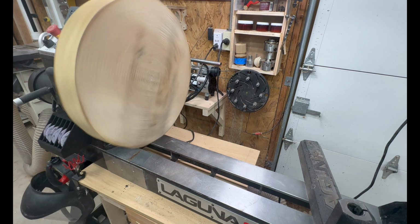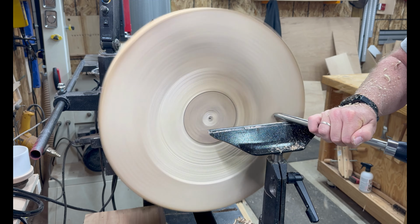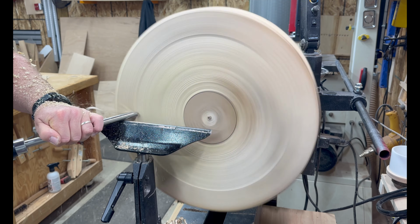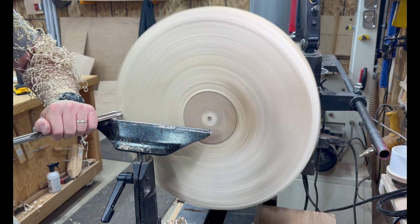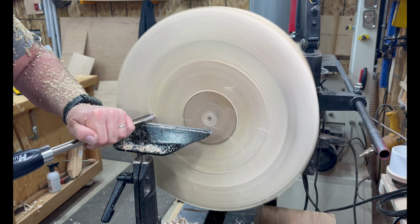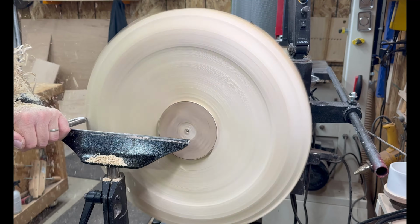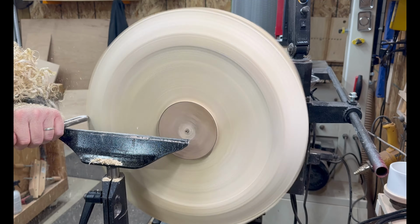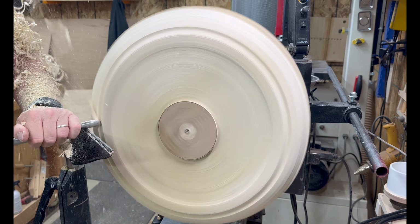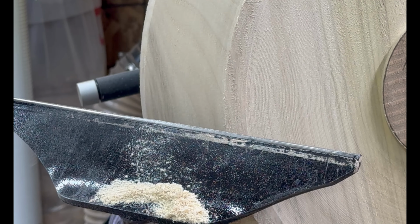Faceplate attached to the bowl round and mounted on the lathe, using the 1/2-inch bowl gouge to shape the outside of the bowl. The grain looked very, very nice. Nice enough to leave out any texturing or painting or even dyeing. Just keep it vanilla. The grain is really magnificent on the outside and the inside. So the bowl shape on the outside is to accentuate the grain, and I've kept the inside to be the same form.